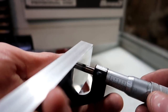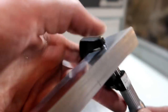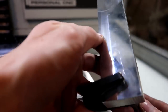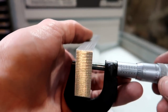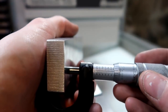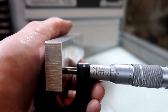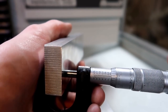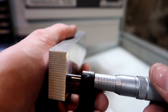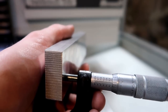On the thick side I'm getting 0.5996 — I set it up to get 0.600 thickness on this stock. On the opposite side I'm getting 0.5987. A little under on both sides, and the left is still slightly further down, which makes sense, but it's a lot better than it was. I'll roll with that and continue to monitor and adjust over time.